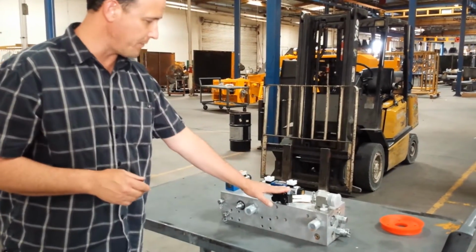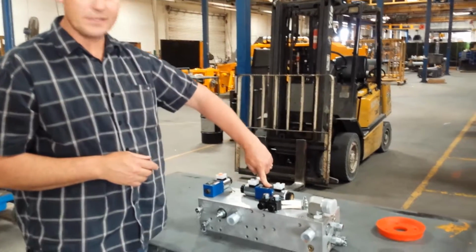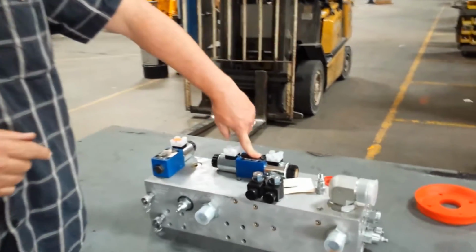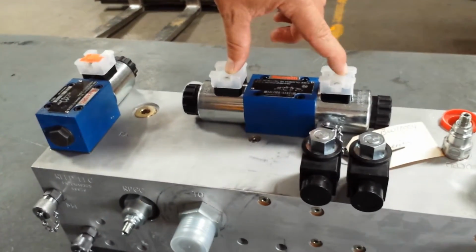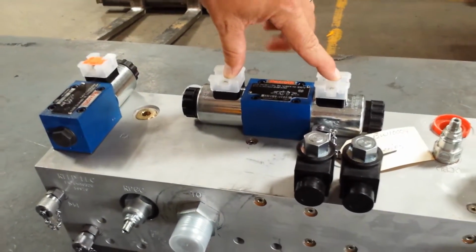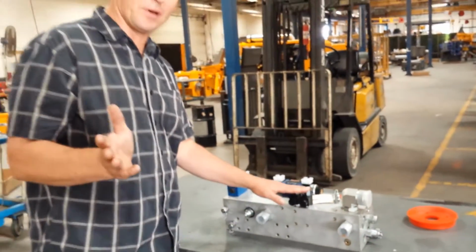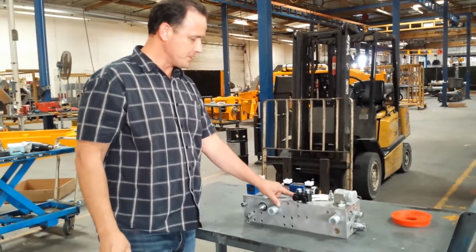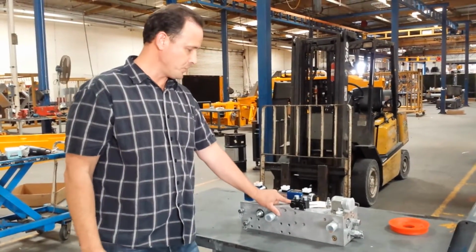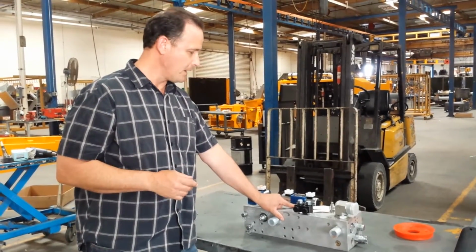Okay, so we have our dump valves here. This is known as a double pilot valve. This valve here is what's making the cartridges cycle back and forth. So imagine we've blown the horn. We've got swing circuit pressure shown on our gauge. This valve is going to have swing tube pressure introduced, waiting, right at the P port, the pressure port.